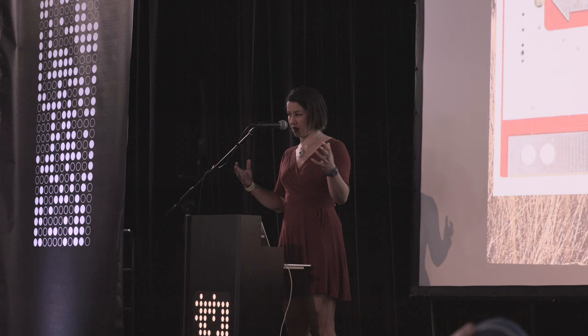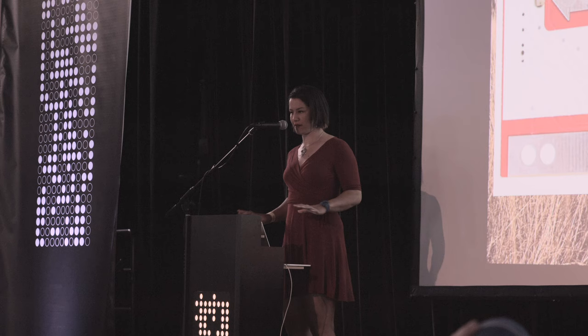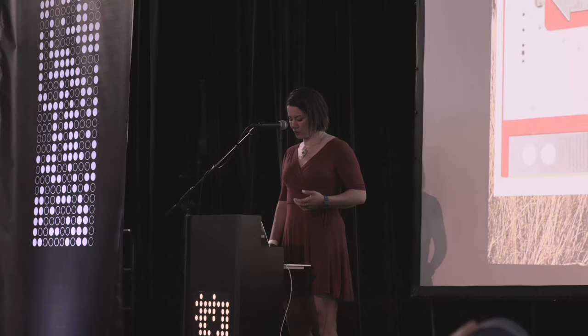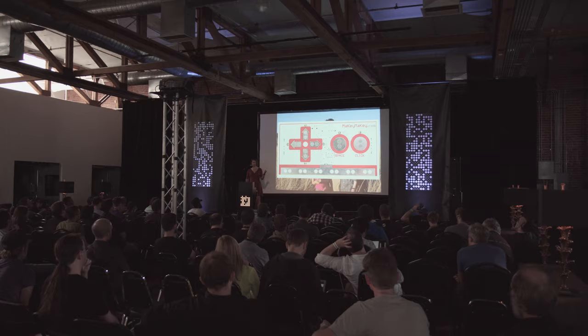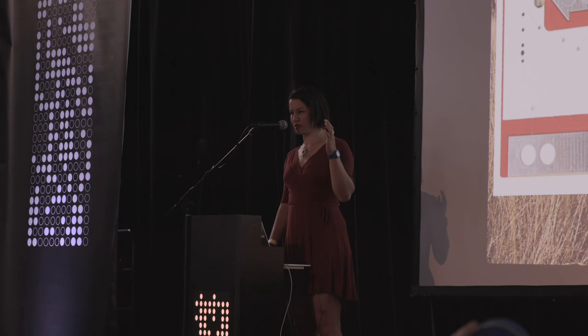And you'll see the logo and where it says space and click. That's actually not silkscreen. Silkscreen has been applied everywhere that's white, and the legend, the writing, is in the negative space. Negasilk lets you do that quickly and easily using Eagle. One reason you might do this is, I think it's still true most places today, silkscreen tends to be a little mushier in terms of how crisp the finish is. And by doing your text with solder mask, or in the negative space, you can get it to look just slightly sharper.